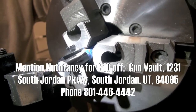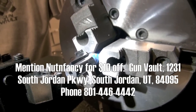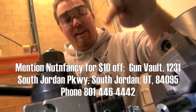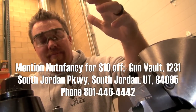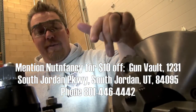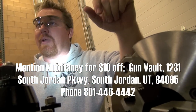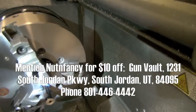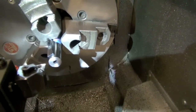Just for some of the stuff I was doing before, I didn't want to change out the whole head, but it has four-way adjustments on the whole body. And so we found center on it. If we can't get center on them in this, we'll change to a four-way independent and make sure we get the bore nice and centered before we cut it off. That way, if you're going to use a cam, it's nice and concentric. Everything's all centered. You're not going to get a baffle strike.